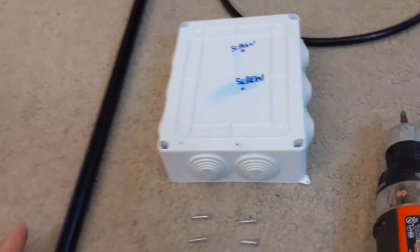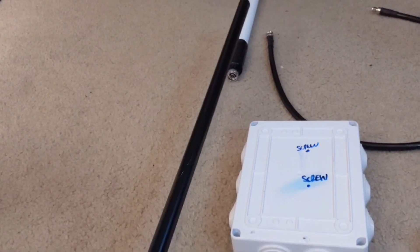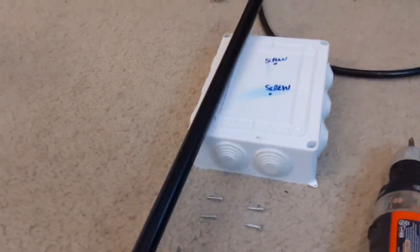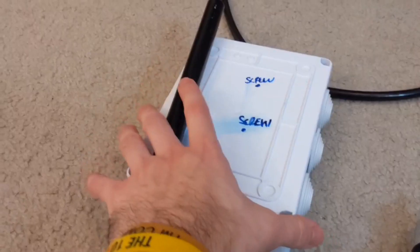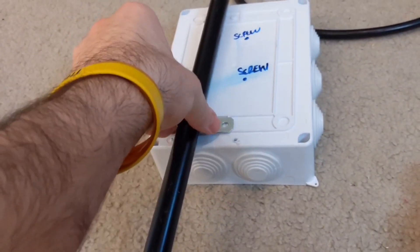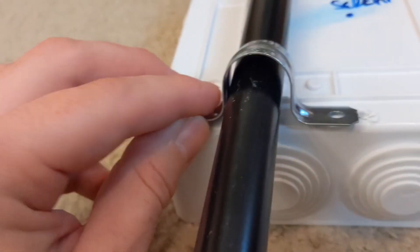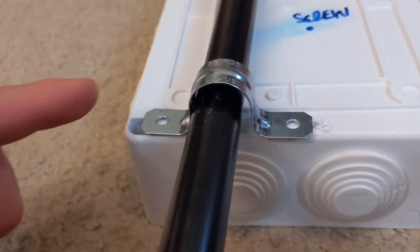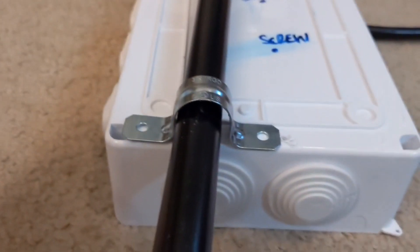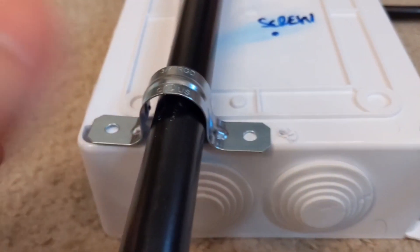Once that's clamped down, I'm going to use this as a metal pole — bear with me, I don't have the metal conduit right now because I've used them all in my hotspots. Some of you might have a pole that's a slightly different size. If you don't get it from Home Depot, I'll explain the hiccups you'll run into. What's most important is creating pressure with the strap on the pole to make it stay, because otherwise this thing will just swing around. You need to make sure you get the right size. With the conduit from Home Depot and the three-fourths inch strap, it works perfectly. If you get something different, you need to make sure the strap is smaller than the pole.